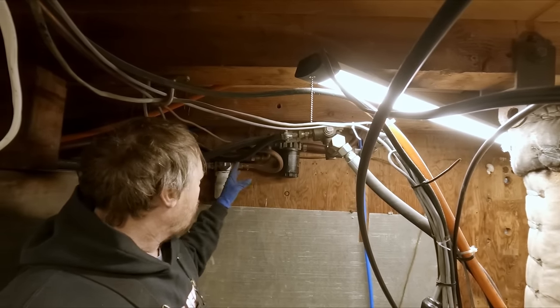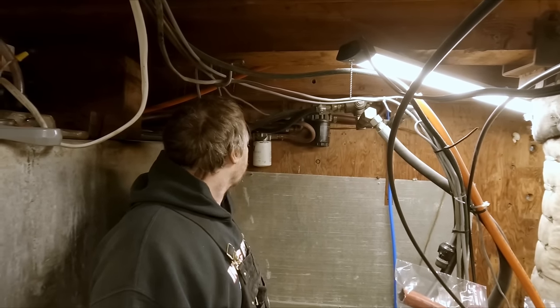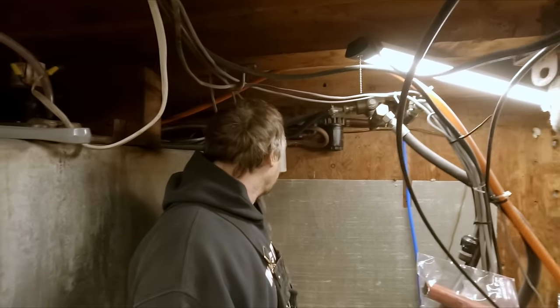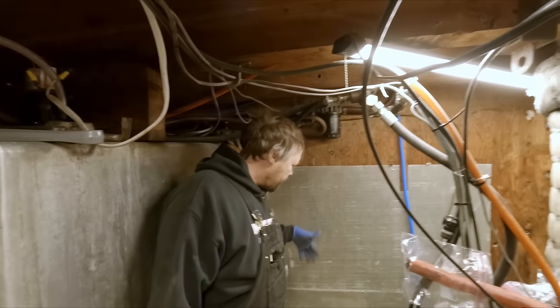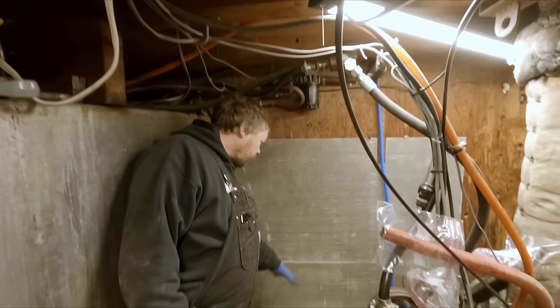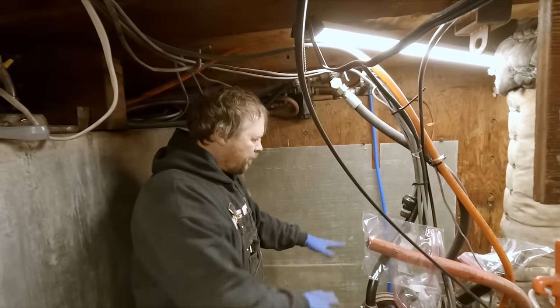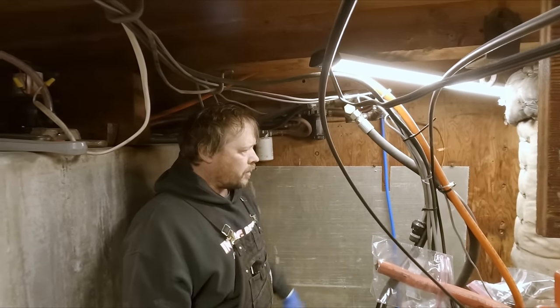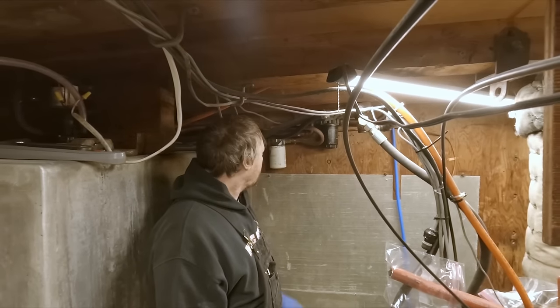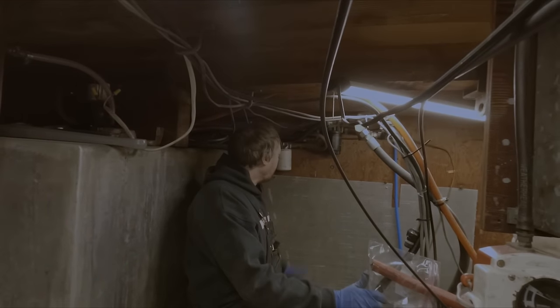We'll put the filter directly off the side of it, get rid of this piece of hose that was joining it, and just generally get that area cleaned up. We want these filters to be in this area where we've got a little sump where our fuel filters are going to be, so it's easier to contain spills and we don't have it over in the bilge area or above our crab pump. So I think that's going to work out real good. And yeah, so that's next.